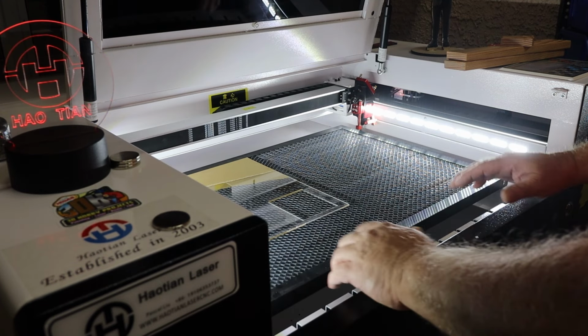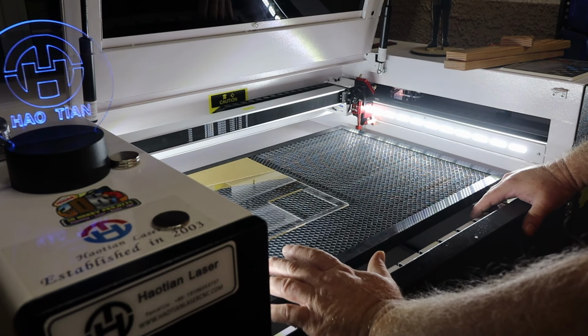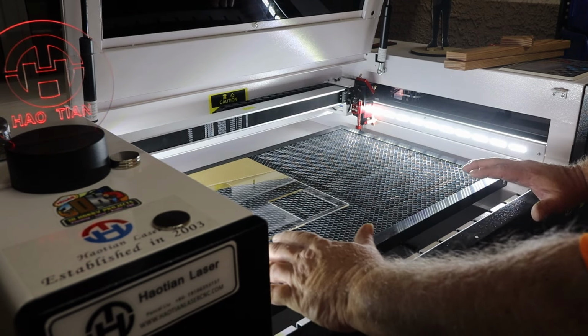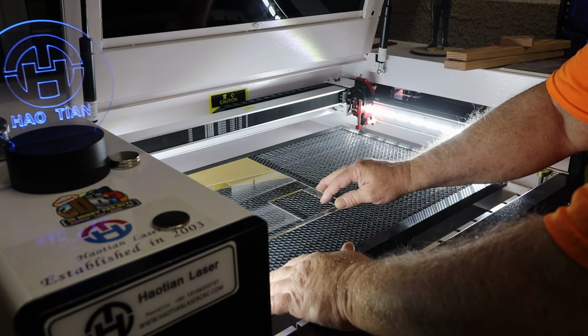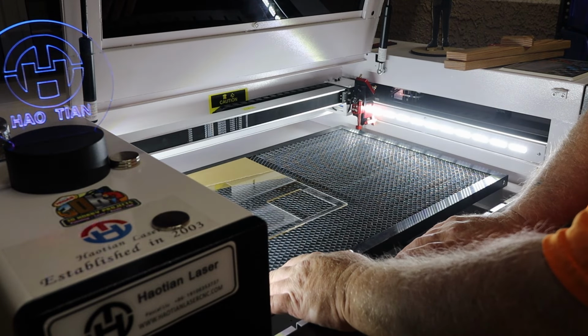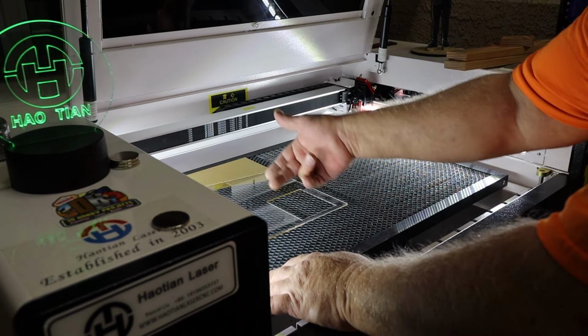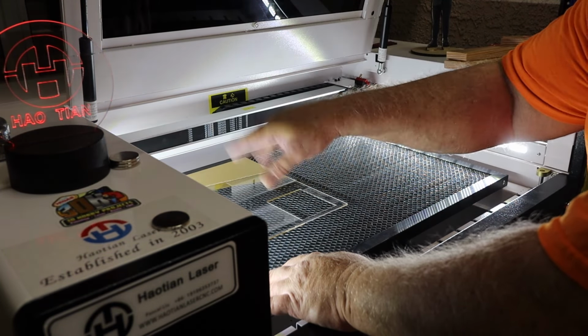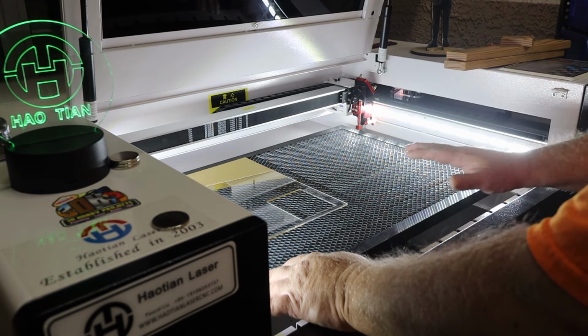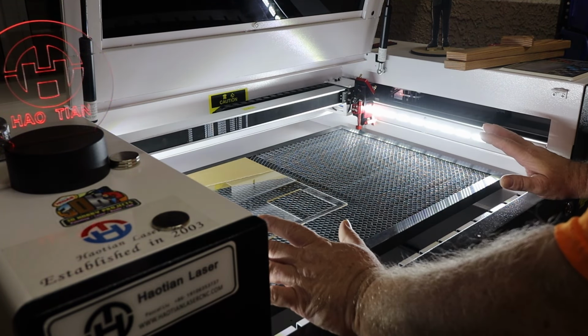One suggestion was simply to put it on the knife blade. It'll stay there, not move. Well, those aren't exact coordinates. It will move around on you. It'll slightly shimmy or move. And when you're up in the top left corner, repeating your work, if something didn't cut all the way through, or you're engraving one after another and you want to simply throw the wood on, hit resume and redo the file, print it again and again, it may move on you. It's not going to be exact.